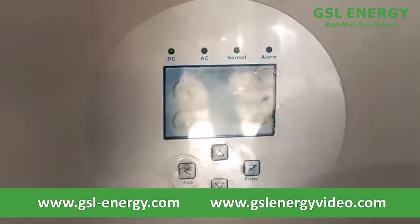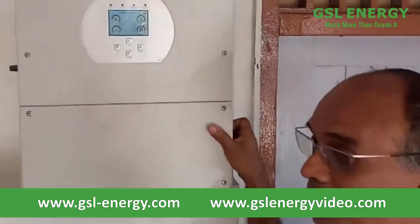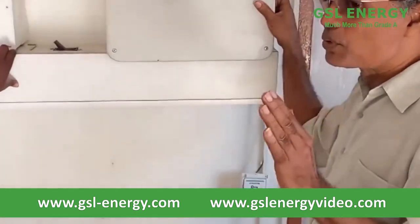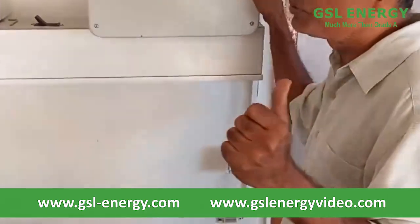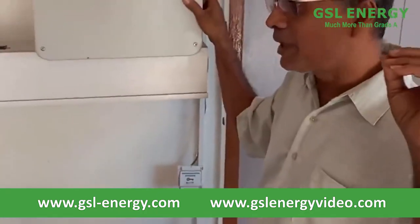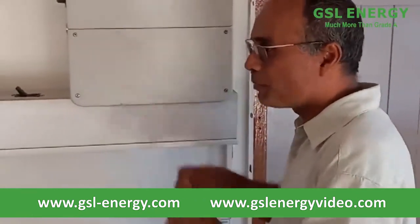Now, inverter AC units work like this. Inverter AC units are actually DC operated units, really and truly. They start at a low power and gradually increase. You don't get a spike in power like the old-time units. An older unit, when you turn it on, immediately draws 1 or 2 or 3 kilowatt of power right away, and it runs that high amount of power and then it trips out.